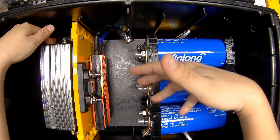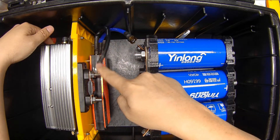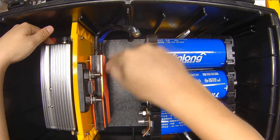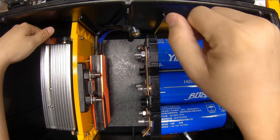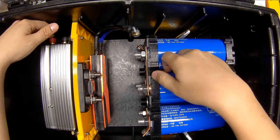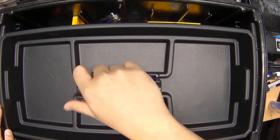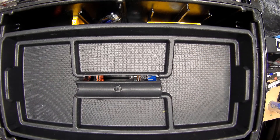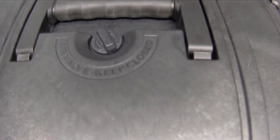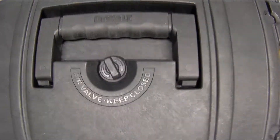So I think I'm going to end up rolling with this pattern: blue lead to the battery negative, black lead to the fuse — this terminal on the fuse block — up to the circuit breaker and coulometer assembly, and so on and so forth. I've got the box, I've got my accessory tray that fits on top, which will hold cables and adapters of various flavors. Unfortunately you won't be able to see the inside of this, but the test fit appears to be successful.